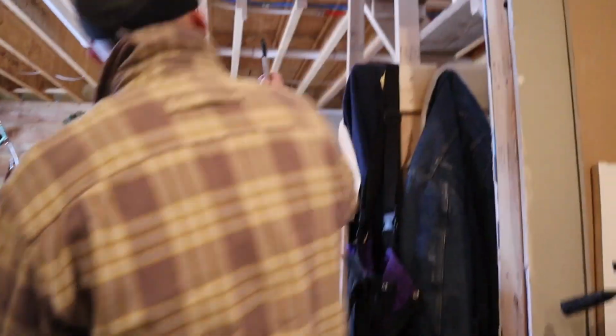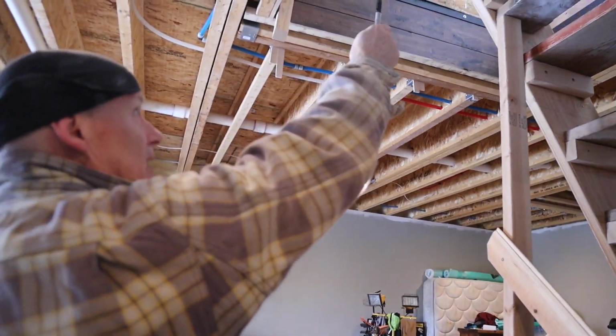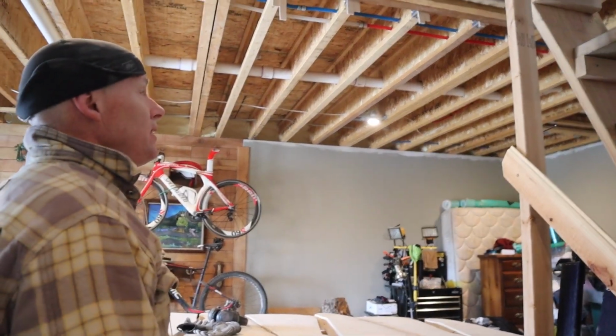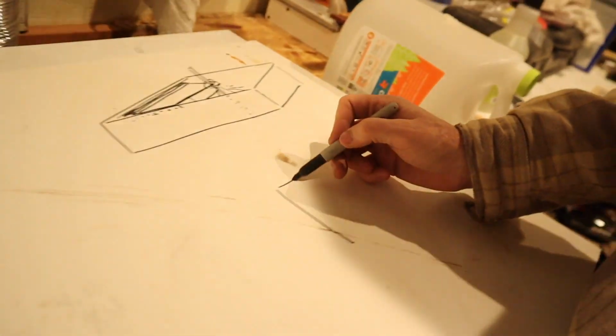Right. Unfortunately, when we put the drywall up, I had written the measurements of center on the styrofoam. But what I'll do is go from corner to corner. That'll find my center. And then I'll drop a plumb line straight down, and then I'll get my center. And what I'm also going to do, this is a top-down view of the square box.